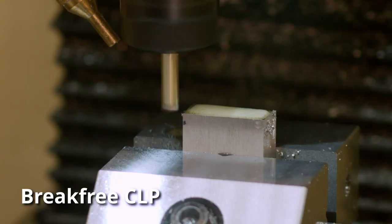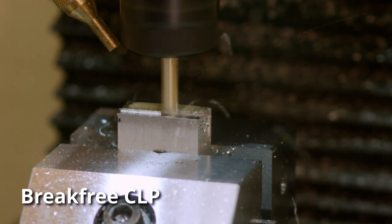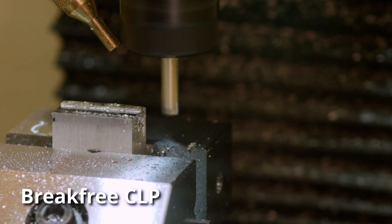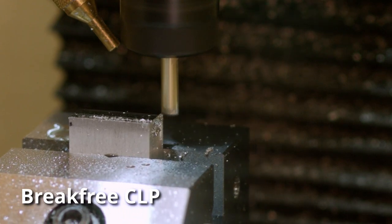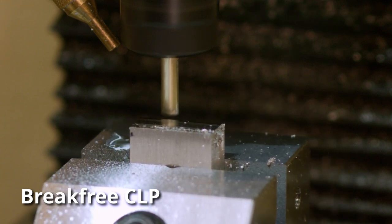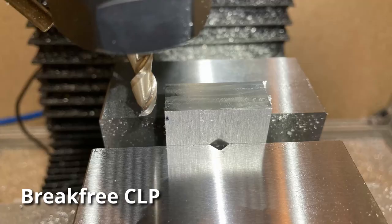Because I was curious, WD-40 being kind of a lackluster household lubricant, I decided to try Break Free, which is another household lubricant that in my experience works a lot better than WD-40. If I have a door that's squeaking and I put WD-40 on it, it'll fix it for maybe a few months, but if I put Break Free on it, it'll fix it for a few years. I figured if it's a better household lubricant, maybe it's also a better cutting fluid. The results were good, but not quite as good as WD-40. I couldn't find a lot of information about the ingredients — it has a lot of trade secret language in the safety data sheet.